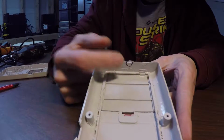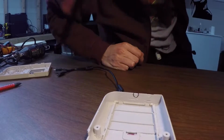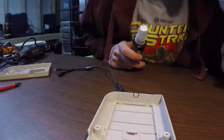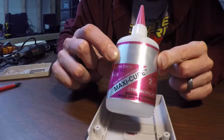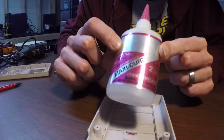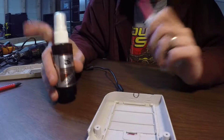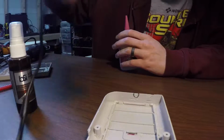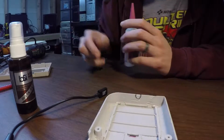What I've already gone ahead and done, off camera, is mount this up here, and all I did was tack it up with CA glue. Which is, probably mispronouncing this, cyanoacrylate, and this is medium viscosity, but basically it's model glue, just a tiny bit of that and some activator, and it sets up really nice. It's really good for tacking things in. So all I did was get it lined up with the top piece, and I just glued it there and I traced it out.